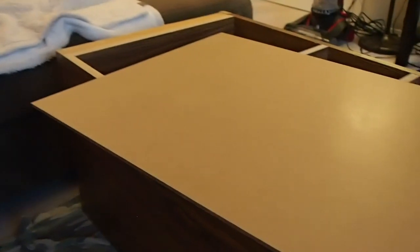Now we're going to add the back. The material I'm using is called Hardboard — you find it in the wood section. I bought it at Home Depot, pretty cheap, maybe 10 bucks or so. I was originally going to do quarter-inch plywood but found this and it was a little cheaper. It's essentially really compressed, almost like cardboard. The danger with this material is if it gets wet it'll get damaged, but I know it's going to be completely sealed off through silicone and vinyl floor, so it'll never contact anything on the inside of the enclosure. And it's lightweight too.